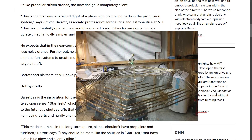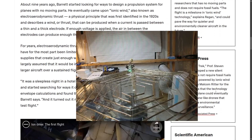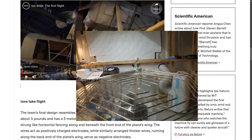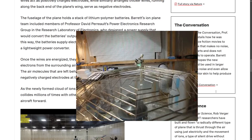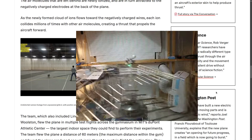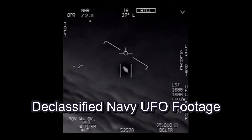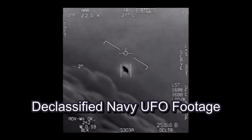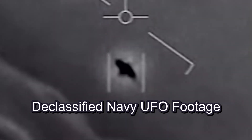This is even more apparent with the design from Cross, where the notion of wings is completely discarded in favour of a UFO-shaped structure where the whole surface area of the craft acts as the propulsion system. With this paradigm, for an ionocraft to lift a heavier weight, the surface area of the whole craft must increase. And as already discussed, one way to increase the thrust is to increase the distance between the electrodes, which also equates to increasing the overall dimension of the craft. As the dimension of the craft increases, the challenge is to keep the ratio of additional structural weight to additional thrust obtained under a certain threshold, while the structure must remain robust enough to maintain the overall integrity of the craft.